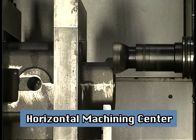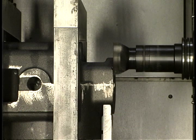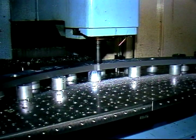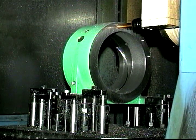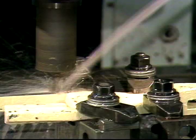This is a horizontal machining center. It is called horizontal because the tool is held during machining by a horizontal spindle. Vertical machining centers are normally used for parts which are relatively flat, while horizontal machining centers are used for workpieces which are relatively cube-shaped or box-like.